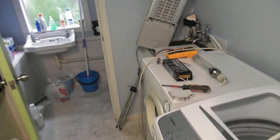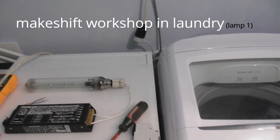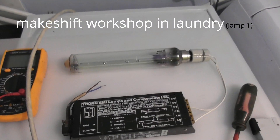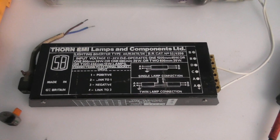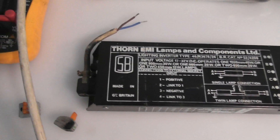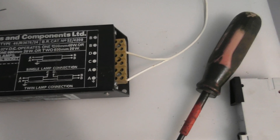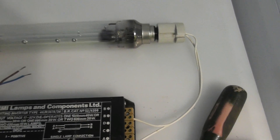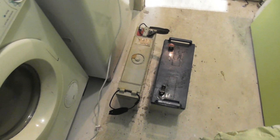I'm going to try this 26-watt SOX lamp which I got from British Rectifier, another YouTuber. I've got a railway inverter here which is supposedly 124 volts output. It goes on these two wires and the output goes into the SOX lamp. I've got the two accumulators here and I'm just about to connect it up.